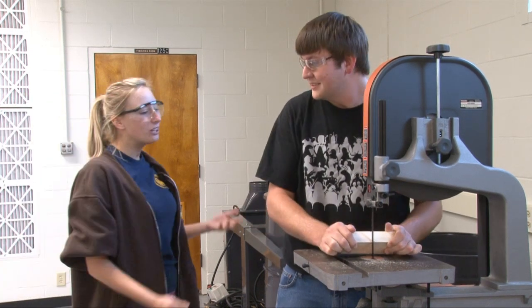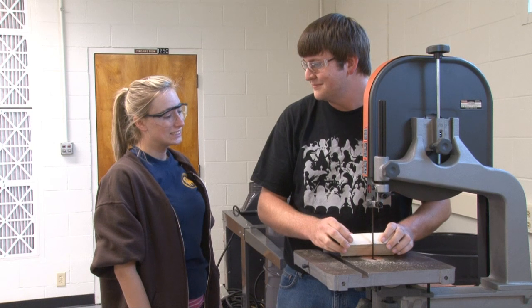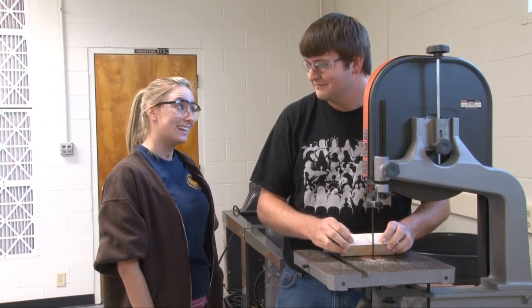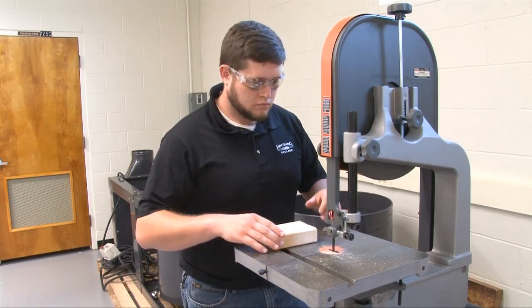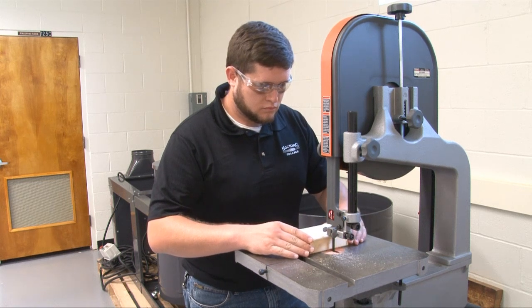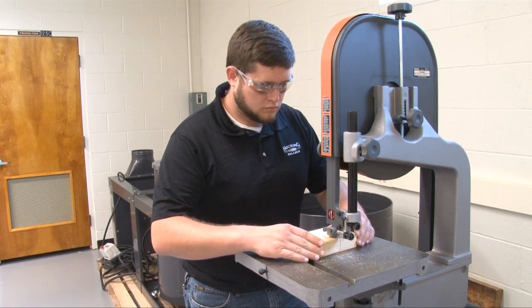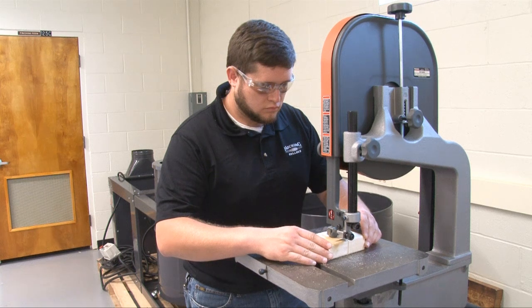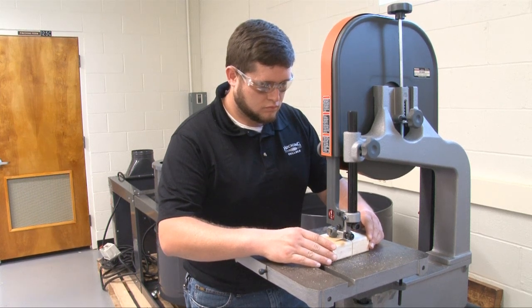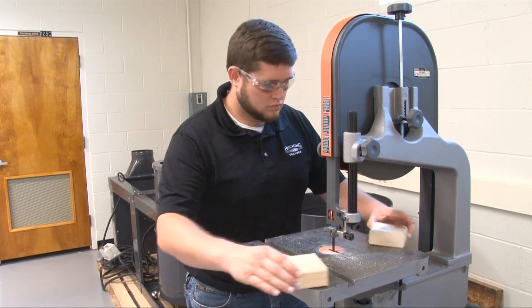What are you doing? Well, I was practicing a fundamental motion in which I could saw when the power was off. Okay — you need to watch your fingers; the blade is very sharp. Make sure the guide is lowered to less than a quarter of an inch above the material; this will assist in keeping the blade straight when cutting. Do not force the material into the saw — let the saw do the work. If the blade has been replaced, make sure the teeth are turning the correct way. If you have any questions, please read the owner's manual or ask the instructor for assistance.